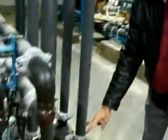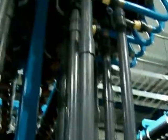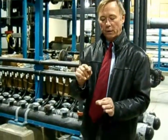Now, what happens if one of those small tubes ruptures because of pressure, the integrity test will pick that up. And there is a process for the plant operators to cure that, where we actually take the cover off the membrane, because you see that these are Victaulic joints. They're only two bolts. This is temporary. This will be pulled off, the connection, the membrane will be in place. This is for sizing. You pull it out, there'll be valves. You shut the valves off, you pull it out, and you take it out, and it will be able to identify the membrane by bubbles. And there's a process where you put a pin in there with what is essentially super glue.